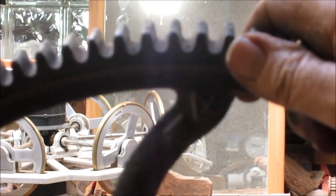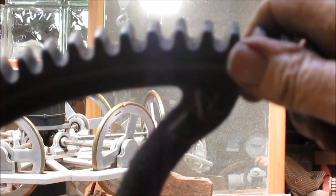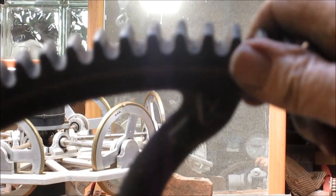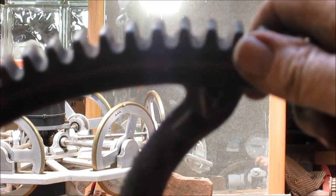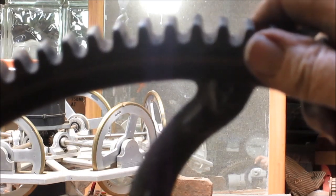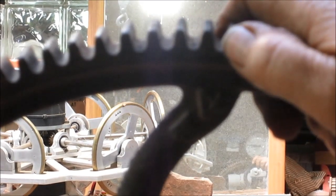And the other thing is that the gear itself is going to travel maybe 2 RPM. So we're not talking about high speed here. We're talking about torque. And I think this is going to work out okay. We're going to do about 4 cuts on that new gear, straight down and come in at just a slight angle, and then come in at an even heavier angle and get that semi-roundness going. So follow along. Hey, we're going to have fun cutting gears.